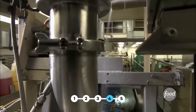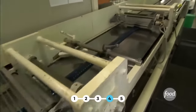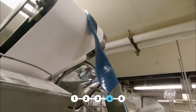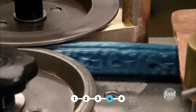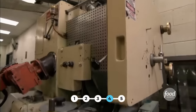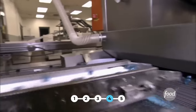Once the moisture is all cooked out, it looks like heavy syrup. The syrup then travels down a pipe into a mixing bowl, where they add citric acid, flavor, and color — this batch is blue raspberry. It travels down a conditioning band and around rollers that inject the center with a confectionary powder. There's a little surprise on the inside for everybody. Machines then form it into a longer, skinnier rope, and finally a die cutter slices it into tiny Warheads and fires them into a cooler.